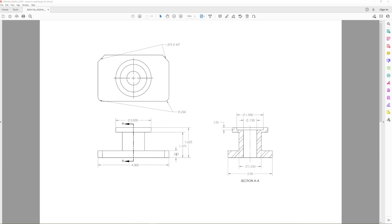Our first level is going to be 3/8 of an inch, or 0.375 tall. If you look here, this is the length of our rectangle and this is our width. So we're going to have a 4-inch by 2.5-inch rectangle and we're going to extrude it up 0.375 tall.